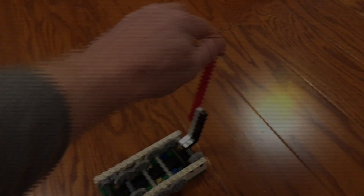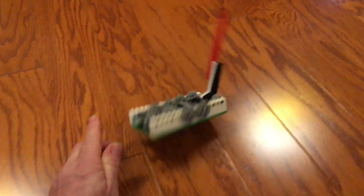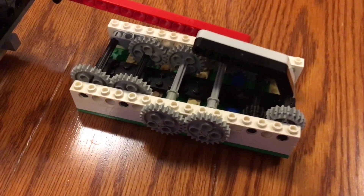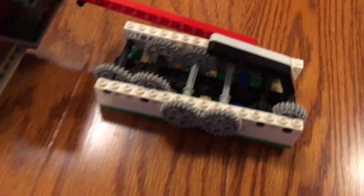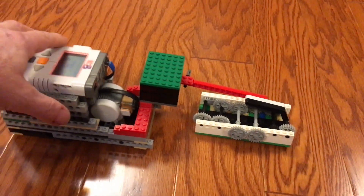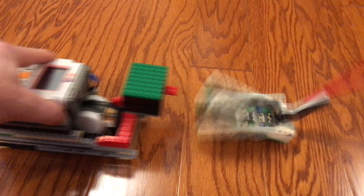But, Mr. Wittig, how do we raise the tower? How about a spring-loaded device — something that you can slide into play and let go. Very simple: you drag it up with the robot straight out, get to where you need to be, and then back the robot away. When you back the robot away, it will raise the tower. Really a pretty straightforward idea — all you have to do is figure out how to put the spring in place.